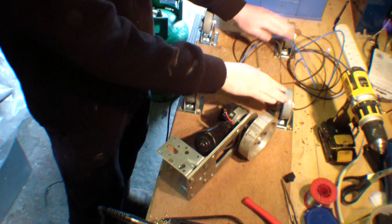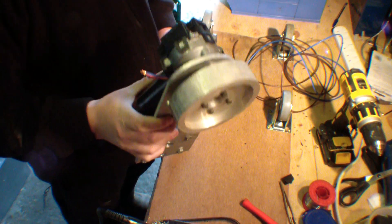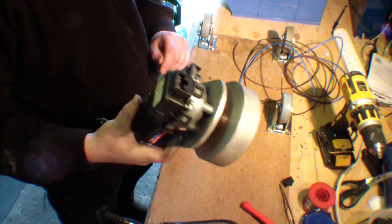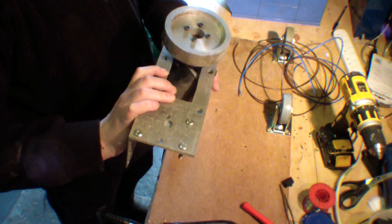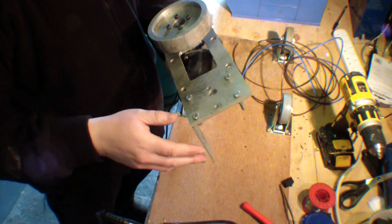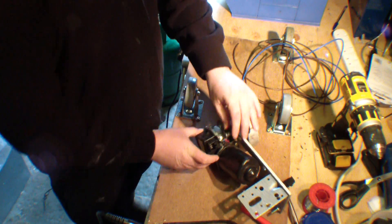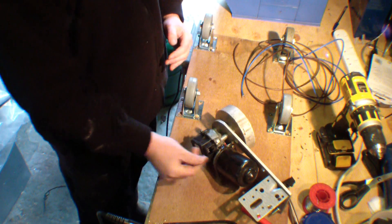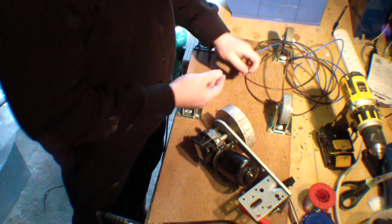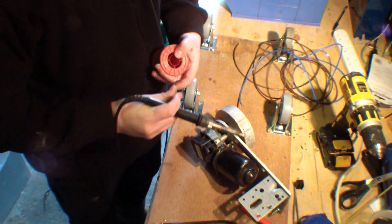So I've mounted some of these roller wheels — that's done. I've got myself a motor. It might be a bit slow but I'm going to give it a shot. This is off an old project that I'd already made, so it will come in really handy for this because I can just bolt it down using that bracket. It's a windscreen wiper motor. There's three wires on it, so it's got two speeds. I'm just going to solder these up now.